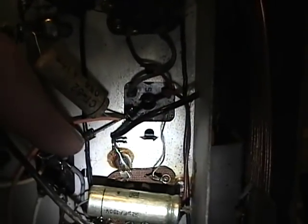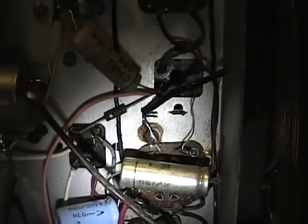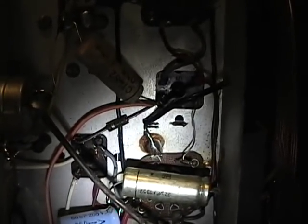I've looked at a lot of these radios, and it's hard to tell if that's an original or a replacement. It's certainly an old resistor, but it doesn't look quite as old as some of the others — like these power resistors down here, which are dirtier and have wax on them from old parts. This one looks a little shinier and newer. And I already know somebody's worked on this radio. All these capacitors are not quite what the schematic called for, so I wouldn't be surprised if the same individual used a resistor that wasn't quite original. That's leaned me toward going off the schematic and putting in all the parts as they were originally specified.